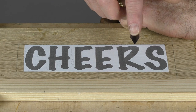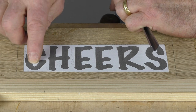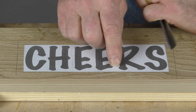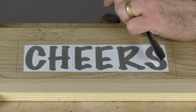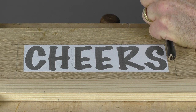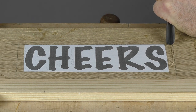I'm going to use my 60-degree V tool to line in, and otherwise I'm going to go around all the letters as best I can inside the waste. So I'm in the waste wood here and outline them. Now that's quite hard wood here, so going across — I'm going to just use my mallet.